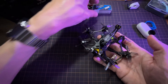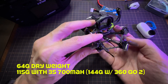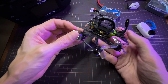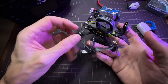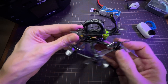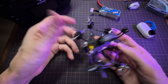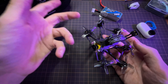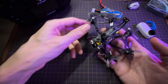For this flying I was using a 3S 700 milliamp battery. These are 1202 8000 KV motors, which are probably a little too big for 40 millimeter props. If I were doing this from scratch again, I'd probably just use 1102 motors, which would be more than enough for 40 millimeter props — maybe 10000 KV on 2S. I think higher KV and lower voltage makes more sense for this setup. It's getting about four or five minutes of flight, which is just so-so, and I think 1102 higher KV motors on a similar size 2S battery would get more flight time.